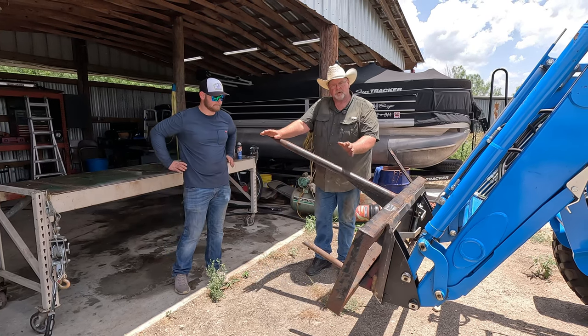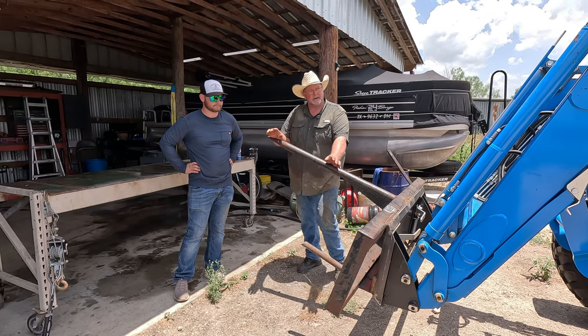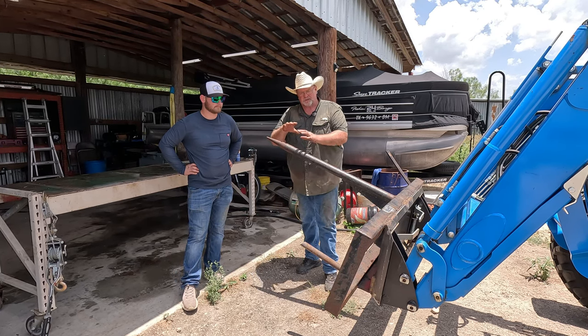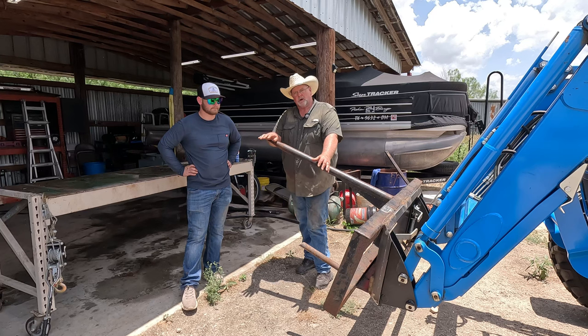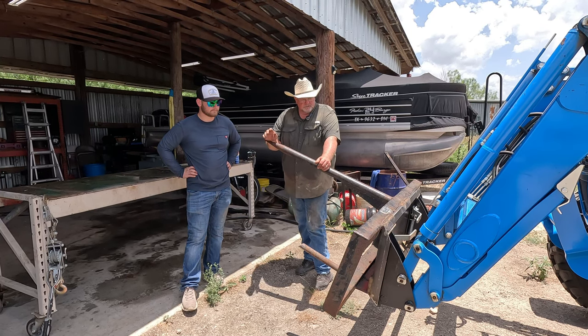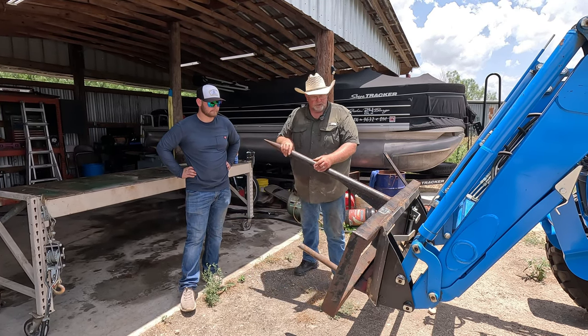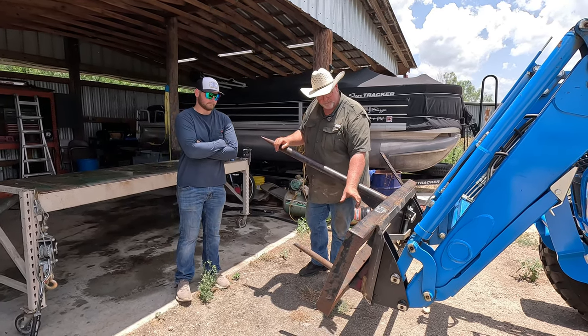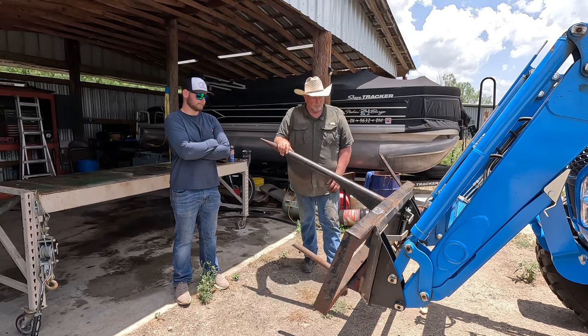So this is a problem that you're going to run into if you have an LS MT573, because you have this self-leveling loader. A normal skid steer plate with a hay spear will not work, not like it should. So what we did is we put a 3-inch angle iron on the bottom. It's 3 inches out away from the bottom, and then basically I just welded it in.